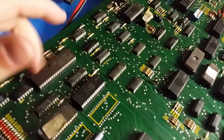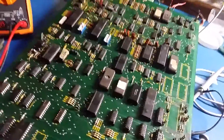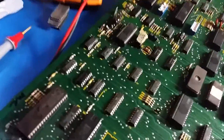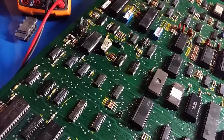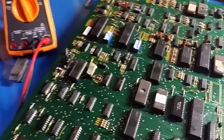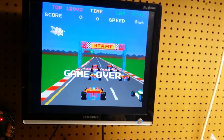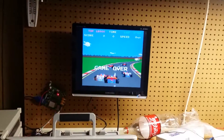This Z8002 chip is really rare and expensive — it was pretty much only used in this game and nothing else. If you look it up, Pole Position is basically the only thing that uses it, so having these on hand is difficult and having working ones is even harder. That RAM 73 error was caused by this chip, and I am ecstatic because no one had posted online what that error means. This is mostly working now with some graphical glitches from the edge connector, but I'm going to double-check and call this fixed. Thanks guys.